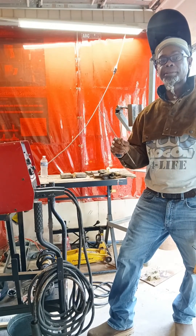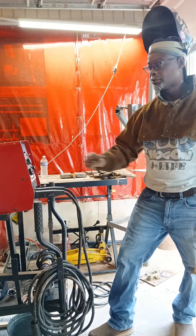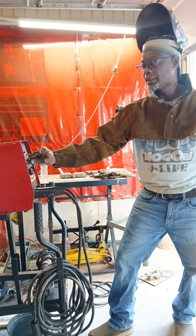I like to have enough heat to make sure I'm getting good penetration, but I don't want to go extreme with way too much. So on this one, they've got an 85 setting and we're going to try to heat it up to about 90 amps.